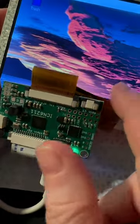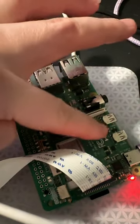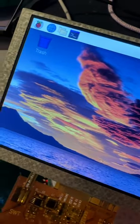So normally, if we were going to drive a display like this from a Raspberry Pi, you'd either connect to the HDMI port, which means you need an HDMI to TTL converter — like the RTD2662 and friends, or a TFP401. But what's nice about this chip is it doesn't use any of the GPIO — they're not connected. It doesn't use the HDMI, and you still get really good quality video, and it's only two bucks.